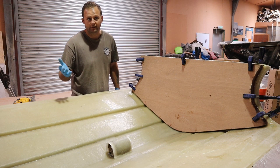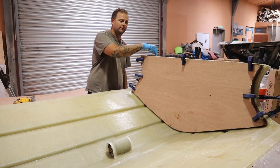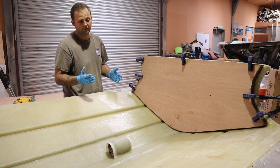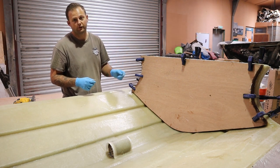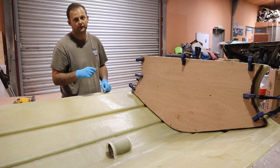So now, let that cure, bringing it in here. We had the original transom laminate, which we had there, so we had four layers in already, okay? So we were looking at a six layer up on this vessel. So I've put another two in now, wet, no consolidating again. They've gone in wet, so you've got the thickness. They've just been gone in with a fluffy roller and wet all the mat out.